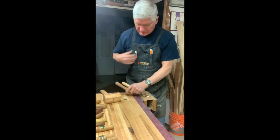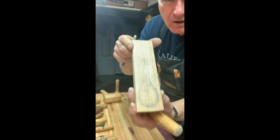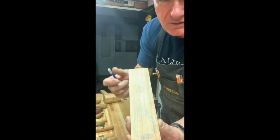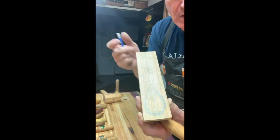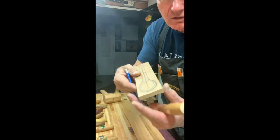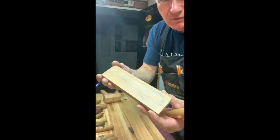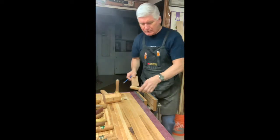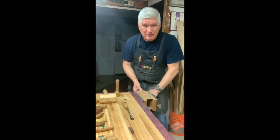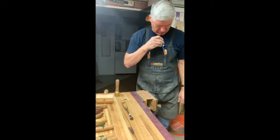I've taken a pencil and drawn a picture of the spoon, then drew an inner circle to mark the rim and the rough bowl shape. I roughly cut it out on the bandsaw to get it into carving mode. This is dried cherry wood — kiln-dried hard cherry — a little harder to carve than green lumber, but it makes a really nice spoon.